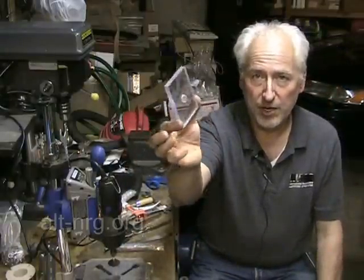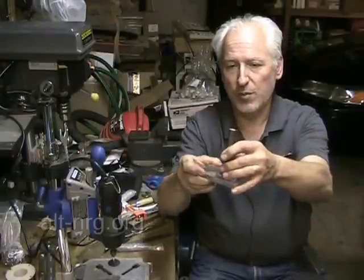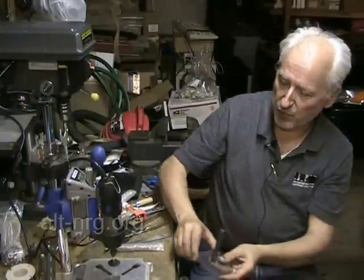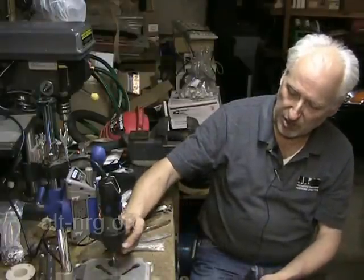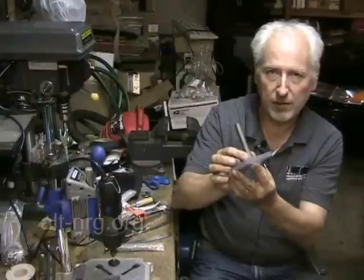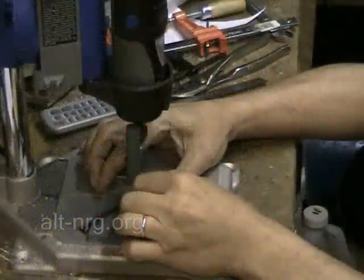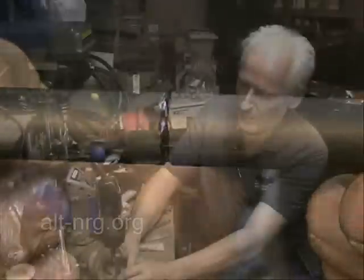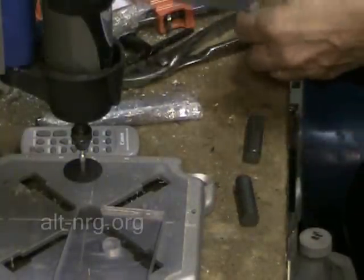To cut them, I've made a little jig out of my three-eighths inch Lexan — just a scrap piece with a half-inch hole to hold my ferrite rod vertical along the base of my Dremel drill press. In the drill press I've got a cutting wheel on the Dremel tool, set to a height that is exactly one half the length of the rod. I'm using my piece of Lexan to hold it vertical and very slowly scoring a line into the ferrite material around the circumference. Then tapping a sharp edge or chisel against a wooden bench and just wrapping it and breaking it across the scored line.